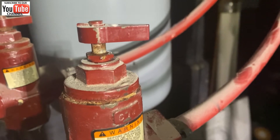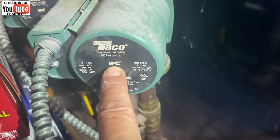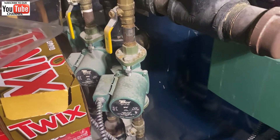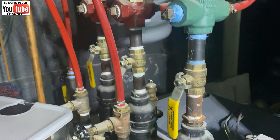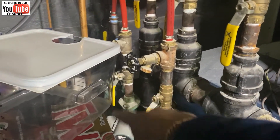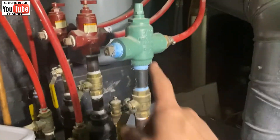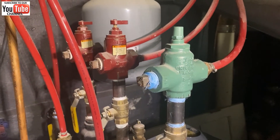The noise is gone, and we can keep it that way because of the IFC on the three circulators. What the IFC does is prevent reverse flow of water. If you didn't have any check valves in any of these zones, if one circulator was on, the other two would have reverse flow — because the circulator is going to try pumping water through the opposite side, up and around and back to the boiler. That's why we install check valves on two or more zone hydronic boilers.